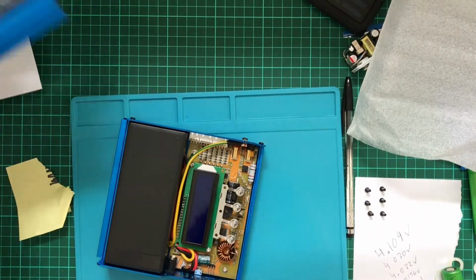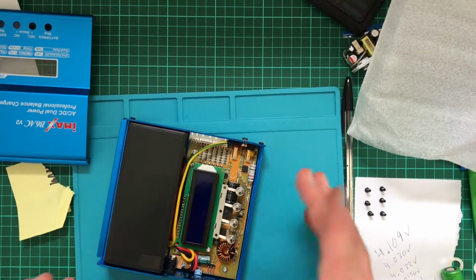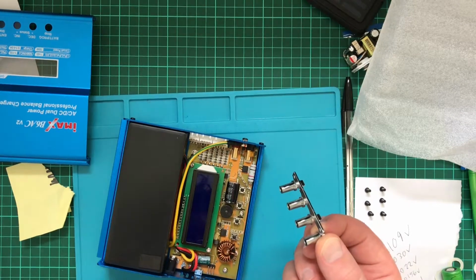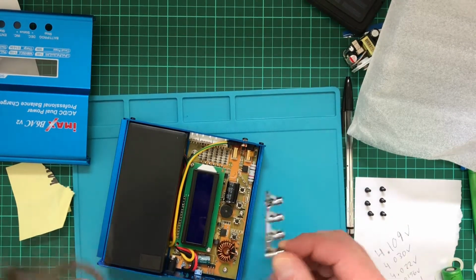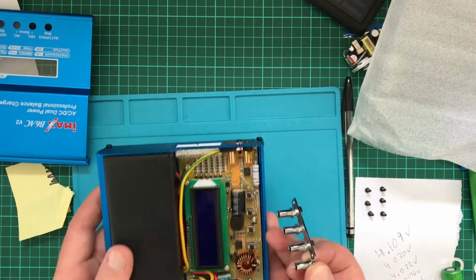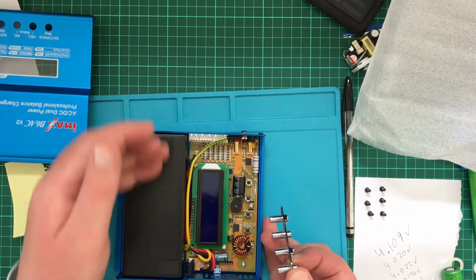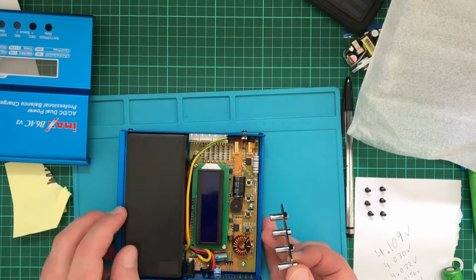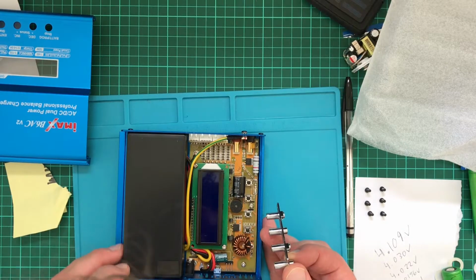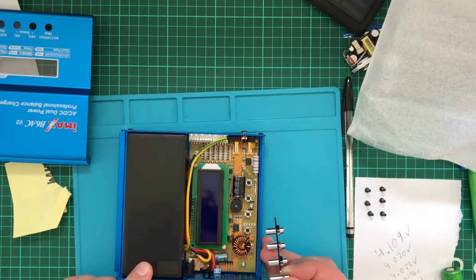So one of the first apparent telltale signs is that this is glued on, which this one isn't, so first sign of legitimacy. I don't see a polyfuse on that. The power supply is also supposed to be the full length. I can see there's an earth connection coming over onto the case itself. I wonder why they didn't have it on this end.